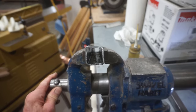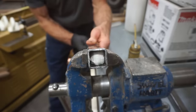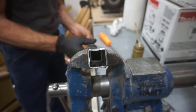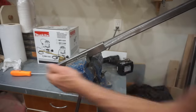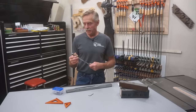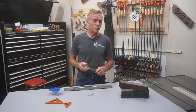When you're done cutting the weld out of a tube, push a rag or towel through the tube with a stick to remove stray and stubborn particles. Assuming the bit and bearing holes are drilled accurately, one pass through a tube is all that's needed for a flawless sleeve fit. Think that's faster, better, and easier than pounding or pulling a blunt force tool through to scrape the weld off? Yeah, me too.